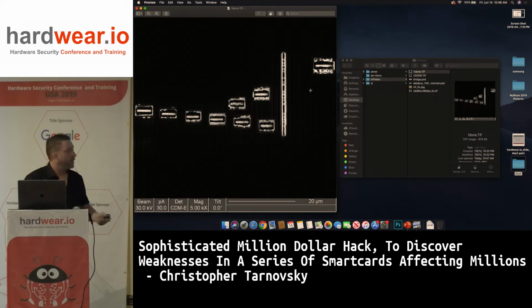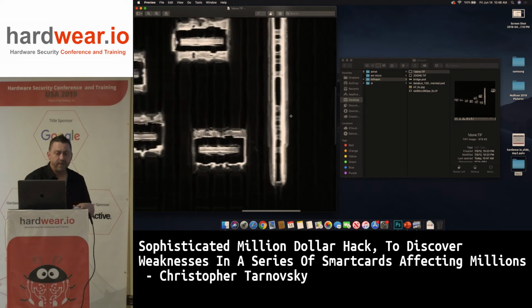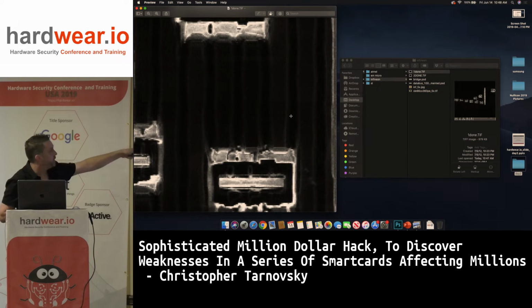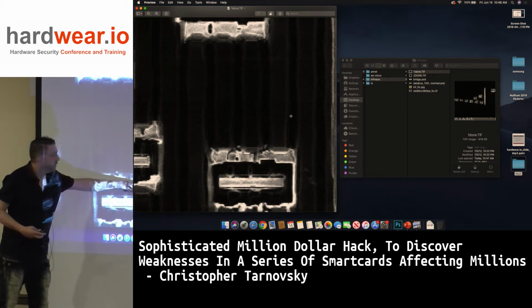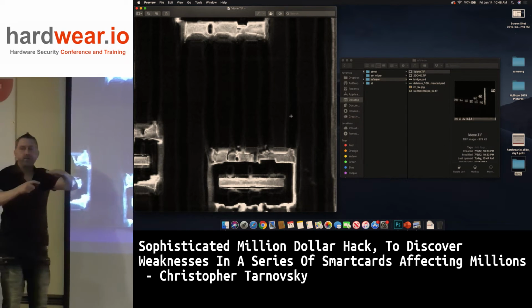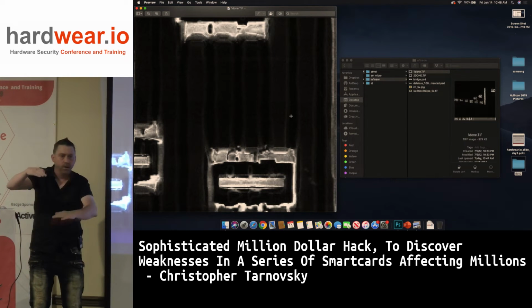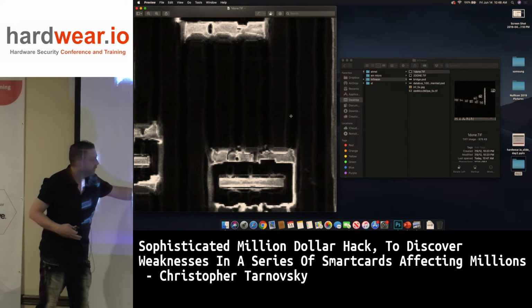So you can see in this picture, you can't see it. I can see it on the Mac. If I zoom in, there's wires here. So on the Infineon shield, I had to make these holes. In these holes, there's 3 wires cut, 3 shield lines, 1, 2, and 3. And then there's a plate of metal underneath. So Infineon put up the shield, a plate of metal, and then the CPU core. So 3 shield lines got cut.